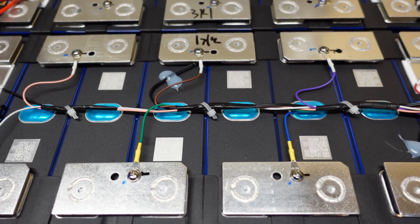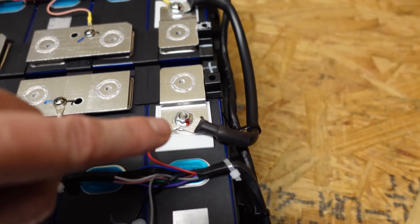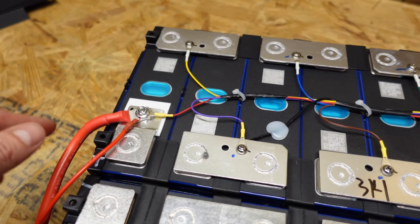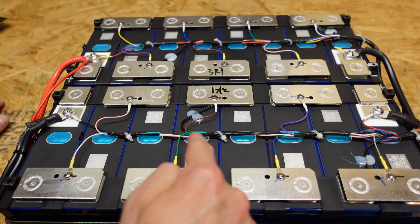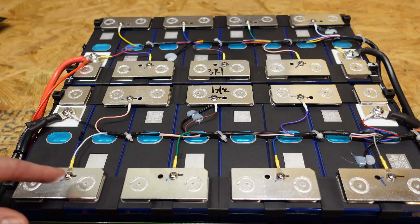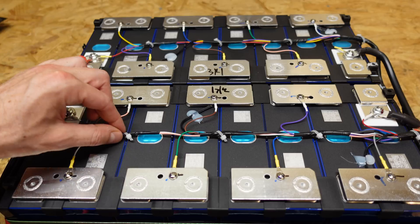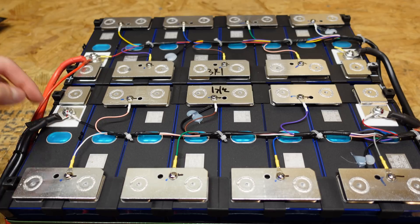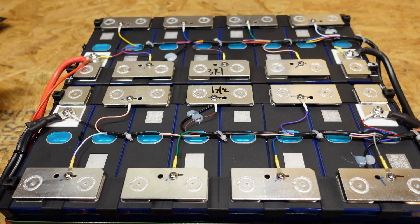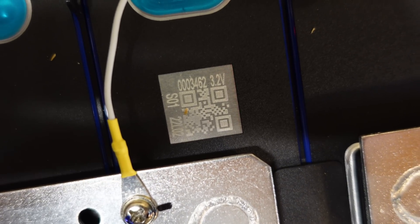As we progress to the right side of the battery, these cells are all arranged in series. On the rightmost side, we have a number six conductor jumping from the first pack back to the second row of batteries, and then we proceed with our series connections all the way to the left where the main positive is located. These conductors running up the center are our balance leads, terminated with ring terminals screwed into the aluminum bus bars — nicely bundled and zip tied to the plastic separators. I also see four different temperature sensors fixed to the battery, all located between the battery and the bus bar.